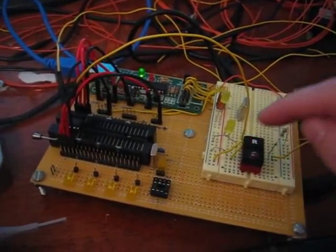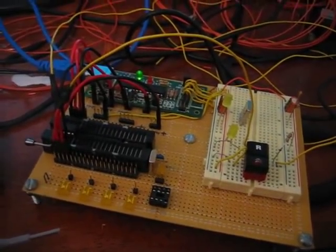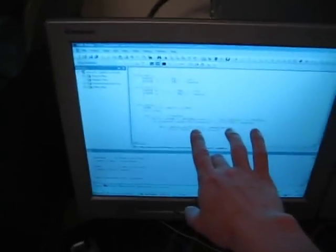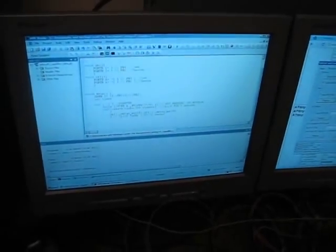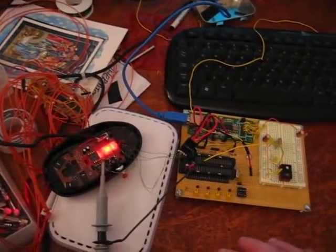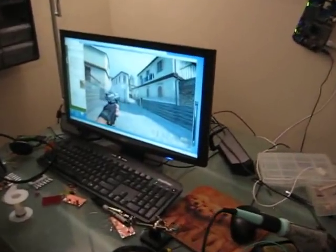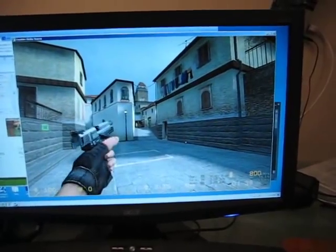Here's one more demonstration. I push it, and it should stay on for approximately five seconds. That should be able to empty out pretty much any handgun in the game I intend to play. I found a bit of a problem — the delay between button down and button up was 1/50th of a second, which turned out to be too fast to accurately fire the mouse. I had to decrease it so it only fires 25 times a second, but that's still good. When I push the button, the oscilloscope will start to go nuts, and more importantly, the monitor will start to go nuts. This thing will fire continuously as fast as it can possibly fire until it's done.